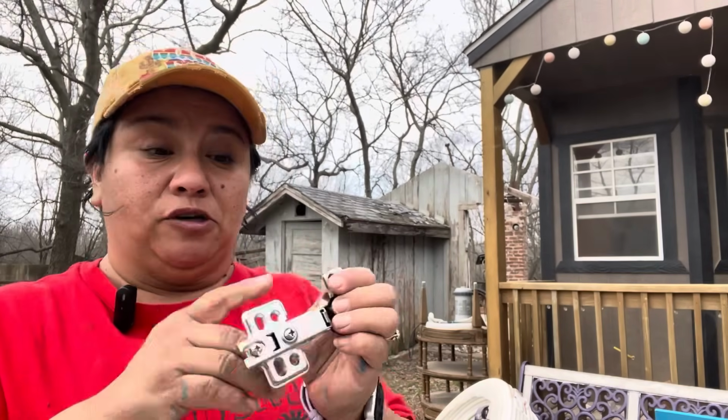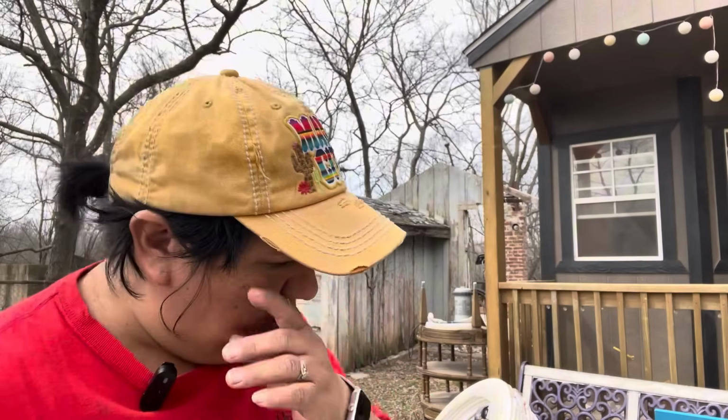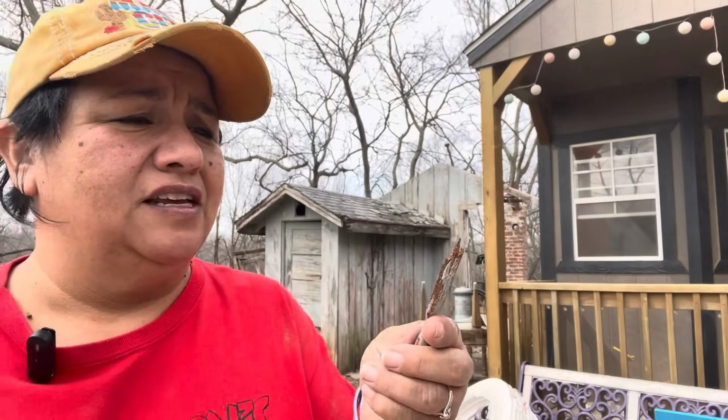All right, so I'm going to take a break from painting for a minute because we want to put this type of hinge on Mama's house. A subscriber sent her the slow close, or soft close, hinges that were on her wish list. So we want to put these in. What we figured out is there has to be a hole in the door for these to fit because this sinks into it. So I got a paddle bit. I think this one, it's pretty rusty because it's Rusty's.